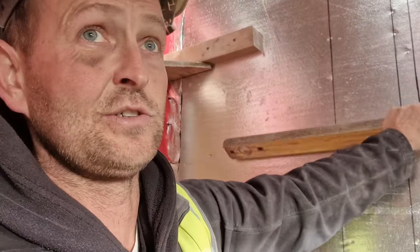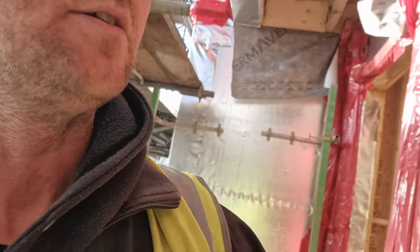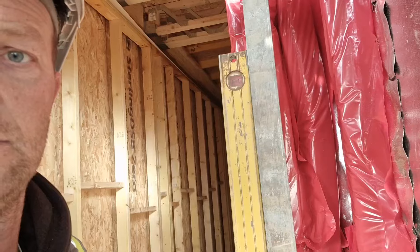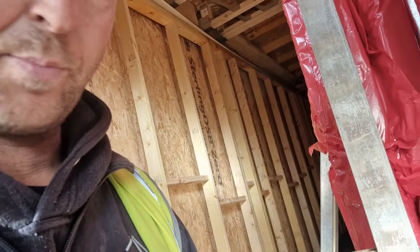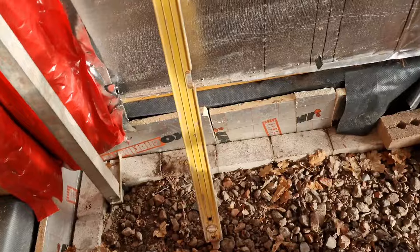These are 75mm cavities so we need 75. Luckily the splash course isn't in. If the splash course was in, you would have to plumb down from wherever the point was on the floor and work it in — you'd have to build it out of plumb. However, the splash course isn't in, so when it's a little bit out here and there we can adjust.